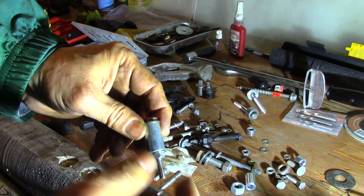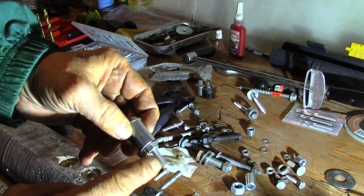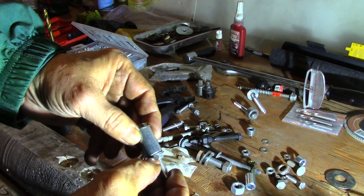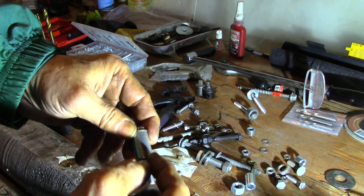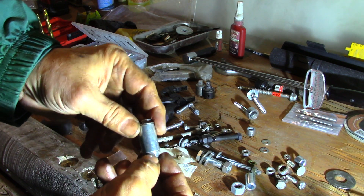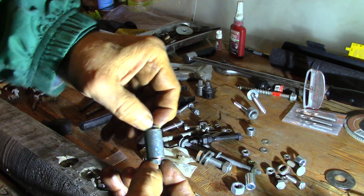When this fails, it could fail here, right? Or it could fail there, or it could fail in the middle. It's not going to fail out here — there's nothing out there. The greatest force is right here within the first part of this nut, the first two threads. That's where we're going to see the failure. Not through elongation, but through rotational torque shear failure, I call it.